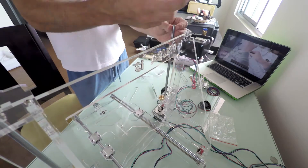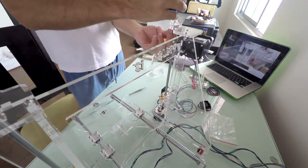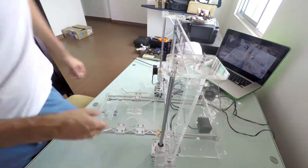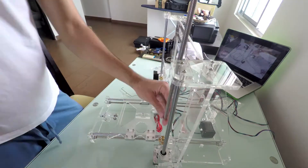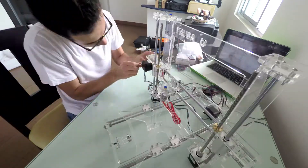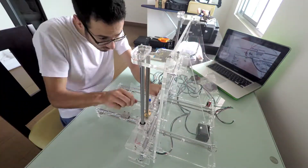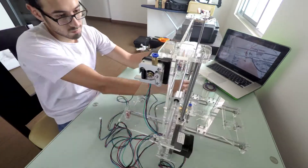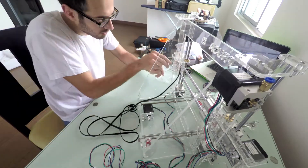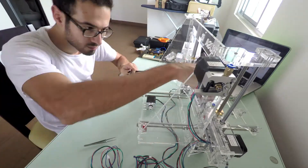Also, before locking the shafts, I slid in both ends of the X-axis. With those in place, it was time to move on to the horizontal rods. These were inserted along with the hotend carriage and secured in place. Then the threaded shafts were mounted to the motor couplings, completing the X-axis. Similarly to the Y-axis, after having this one in place, I made sure the hotend carriage could move freely, adjusted the screws, and secured the tracking belt in place with the help of some tweezers.